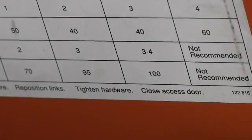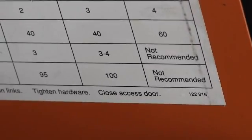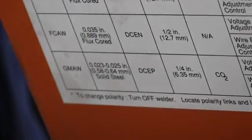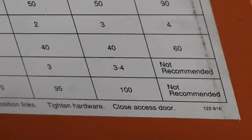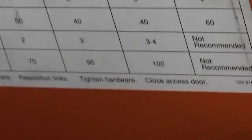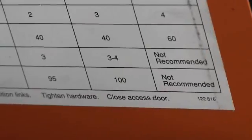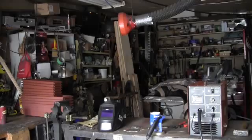Now this is not like a lot of the Canadian Tire welders and whatnot that you see. They say you can weld a 1/2 inch steel, build a boat and come back for more. That's bullshit. This is recommended. After that, it would get dangerous. If you were trying to build something structural and you were welding thicker than 13 gauge, you're asking for trouble. So let's pause this again for a second.